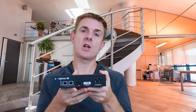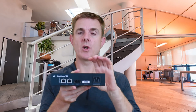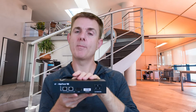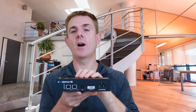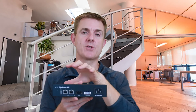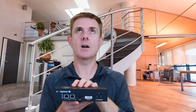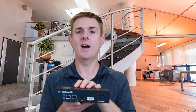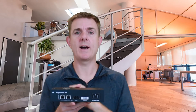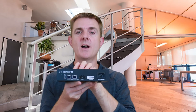The idea of this is for out more on your site where maybe mains power drops in and out. So you could plug this to your mains, then plug it to a 12 volt battery for additional power to carry you through any outages, and then up to your antenna — maybe a NanoStation or Loco — to provide your point-to-point links.